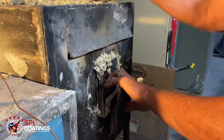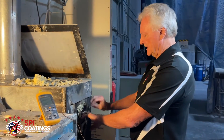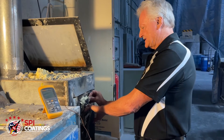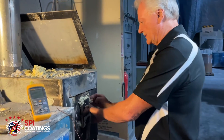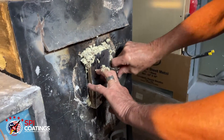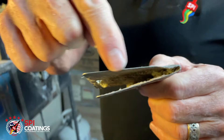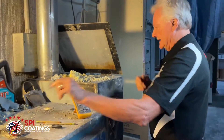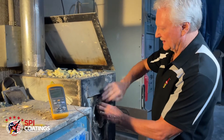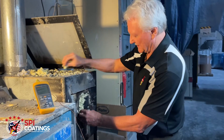This plate is not a thick plate. In regular fire testing you'll have a six millimeter up to about a 13 millimeter thick steel plate. To really get an understanding, we're using a very thin plate — you can see the thickness right here. Heat is going to come through that very quickly, but it'll let us know how well we're doing before we move up to a thicker plate.